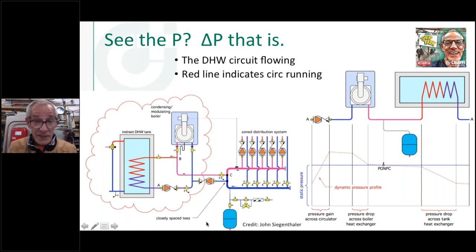I know there's different opinions on that, even from the boiler people out there, as far as what's the primary loop and what's the secondary loop. But that's how I understand it, the loop that has the expansion tank. So one way you could figure out what's going on in the system is make a graph of it. Now, you could put numbers to this. If I knew what this piping was, what size, what the elbows were, if I counted up all this and determined my developed length of all that tubing, I could put numbers on this.